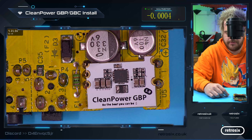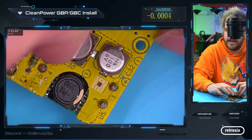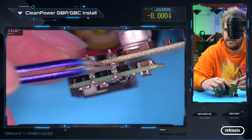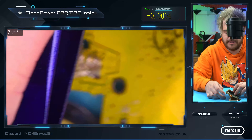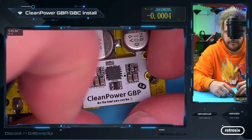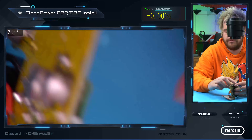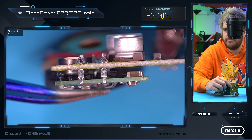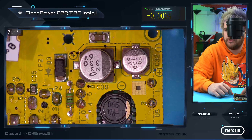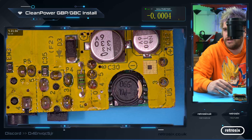The simplest way to test this would be to install this mod with three wires: one to power, one to ground, one to 5 volts. Then you would cut the 5-volt input on the original regulator — just snip that off and bend it out of the way. This would prevent the original regulator from running. You can test your screen and see if it works fine with brightness. If it does, go ahead and remove the old regulator. Otherwise, just bend the cut pin back and solder it — you haven't made any major changes before you've confirmed. Or simply remove the old regulator, install the Clean Power, and if you find you need the negative voltage, reinstall the old regulator. It all depends on how comfortable you are with your soldering skills.